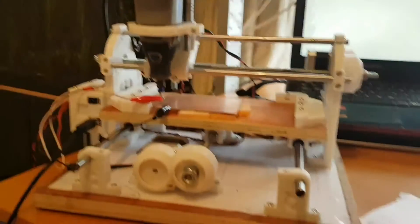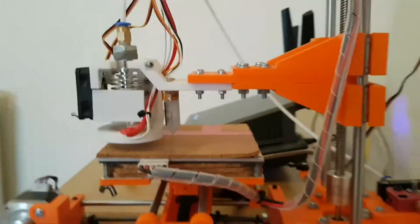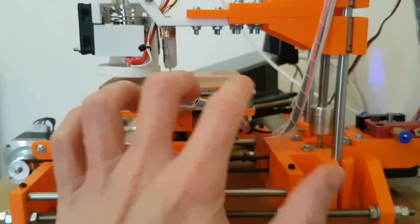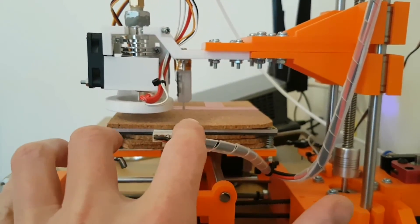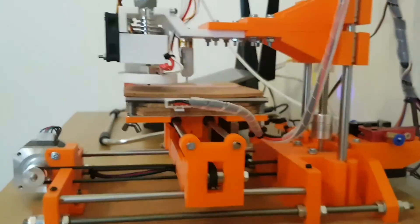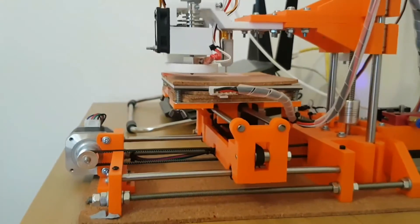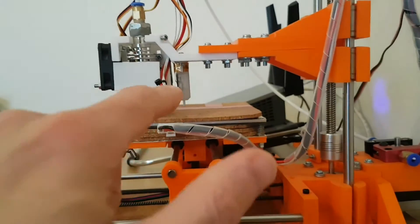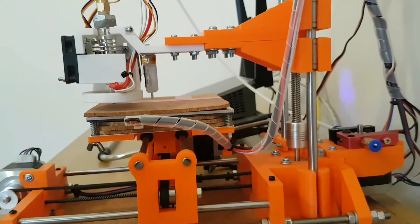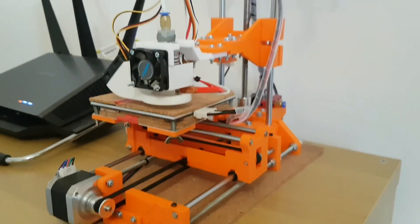So yeah that is to come - a bit more of a video on that hopefully. In the meantime I have actually got the BL Touch on the little homemade Atom X which is working fine. I did a video but I did not upload it. The only problem is because I have got the BL Touch I have lost half the work area more or less, so I have had to buy some longer rods. It is working - it has printed stuff out including parts for the PCB maker. Once I have got those on I will do a video showing how I set that up. I have put Marlin on it now because to get the BL Touch working I found it really a headache with the Repetier firmware. So I configured Marlin and got the BL Touch working. So that has been sitting there for a while. I will get that back up and running - hope you are all well and I will see you soon. Cheers, bye.